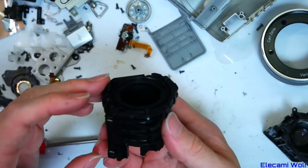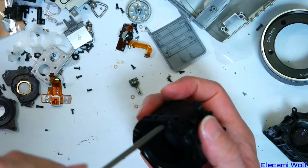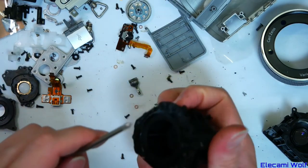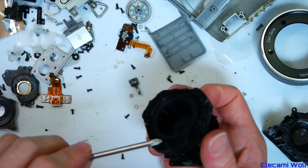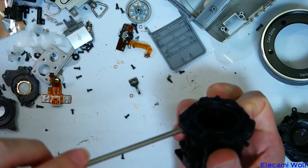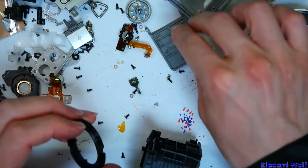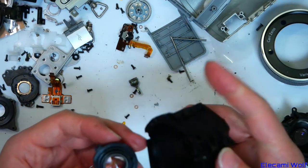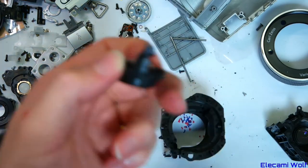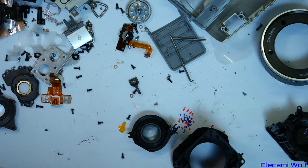Let's take apart the rest of this. There's one part that moves as part of the zoom operation, and that's just a shield holding the rods. There are some adjustment screws — they might be controlling the positioning of that lens. Screwing them in lifts it up. Those are silver steel rods that the lens rides on, and a threaded shaft for moving in and out. That's just a housing now. Let's clean up this mess and look at the circuit parts.